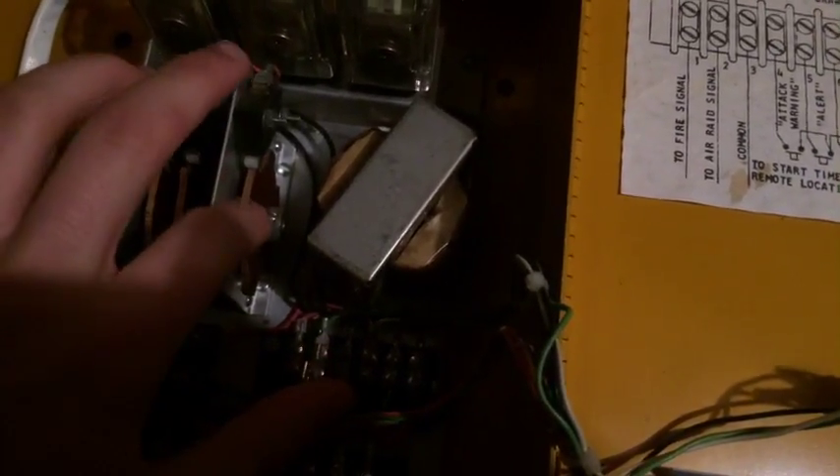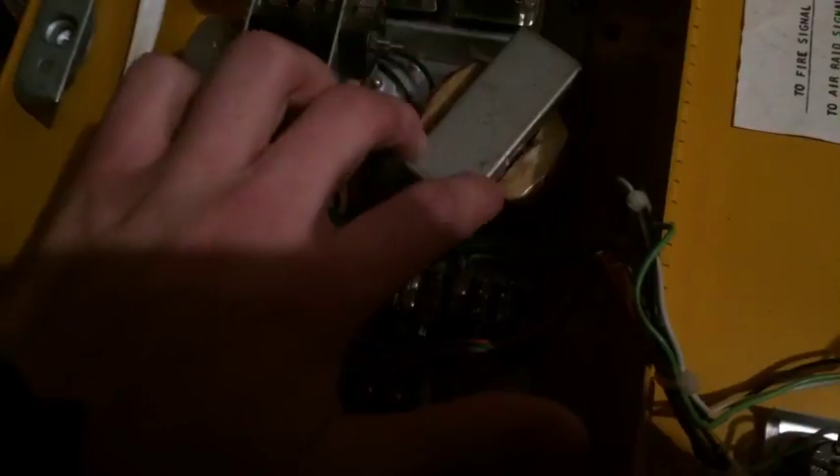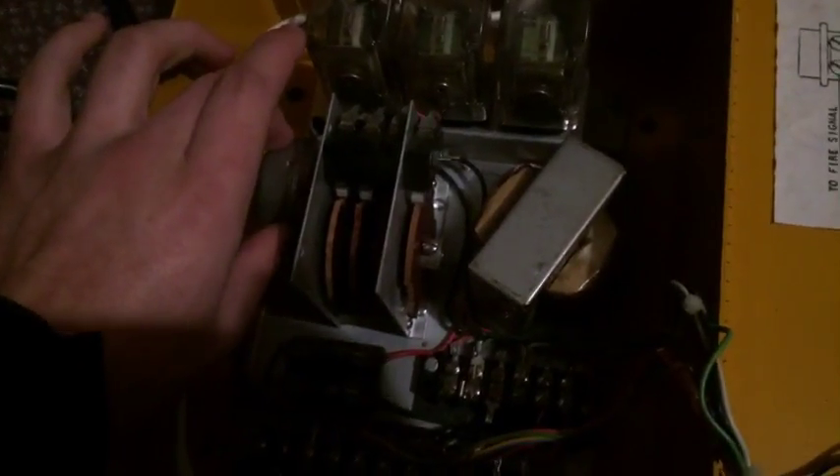Now we can dive into things. This is your power transformer. The AFs and ARs run on 110 volts for the most part. There are components in there that can run off of pretty much any voltage, but there are components in there that are set to run on strictly 110 versus 240. So if you're running your AF timer or AR timer on 240 volts, you hook it up to terminals 8 and 10, because it's going to go through and send it to this transformer to step it down to 110. That way you do not fry your clock motor, which is an example of something that runs off of solely 110 volts.